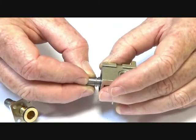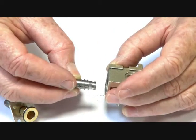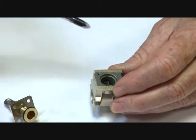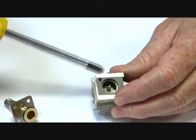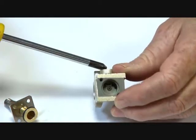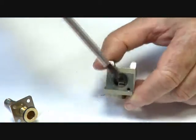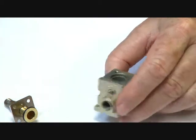When the coil is energised, the armature lifts off the seat, which allows the media or air to come up through the jet and out through the cylinder port here. It goes down through a gallery on the side and out through the cylinder port.